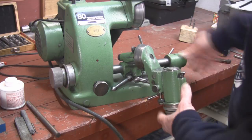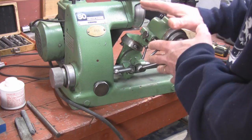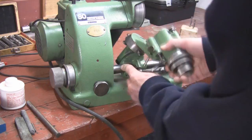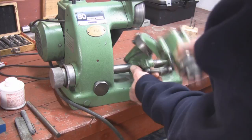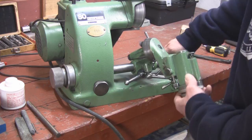This locks the whole bar. When I loosen this, I can move this back and forth. This lever here — if we loosen that and tighten the one on the right, that tightens the whole tube down so we can move this wherever we want. We can drag it right, drag it left, and move it back and forth. The reason you have to do that sometimes is because you run out of travel with the various vernier scales, and you have to loosen the whole thing and get it to come over or back up, get it close, then lock it. Then loosen the bar on the right again so the cross slide tube is free and the carriage goes back and forth.